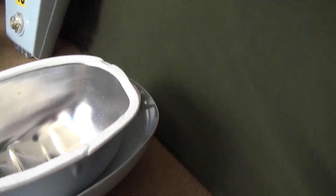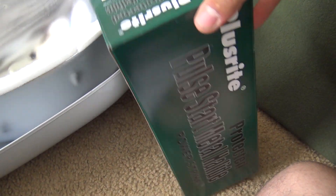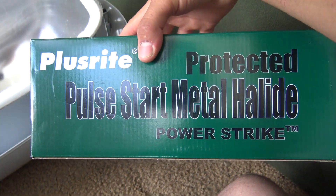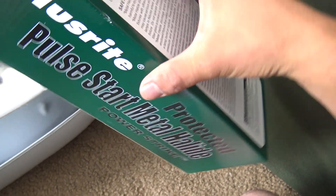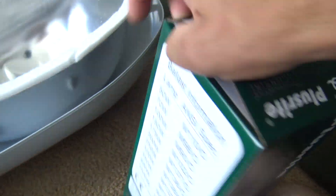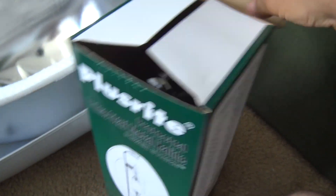There's also a warning sticker that pretty much says this ballast kit is to be used with pulse start lamps only. No other lamp can go in this fixture — maybe a high pressure sodium lamp, but they don't make 320-watt high pressure sodium lamps. Let me go ahead and show you guys the lamp I got for this fixture. I went on 1000bulbs.com — a really good website that sells many different types of lights — and I bought this PlusRite 320-watt pulse start lamp, which just came in the mail today.